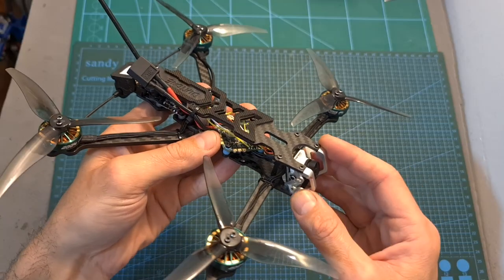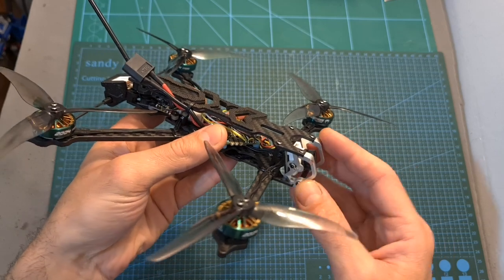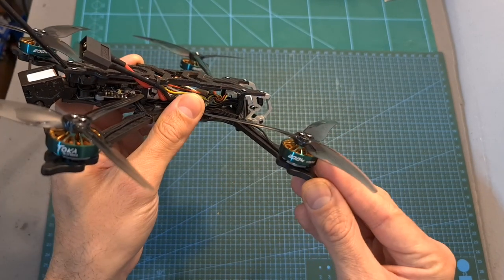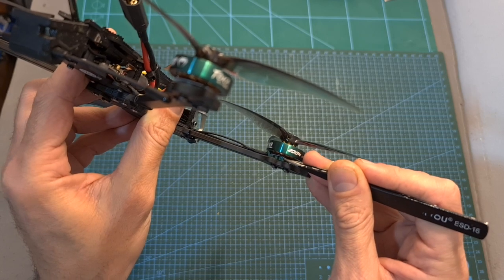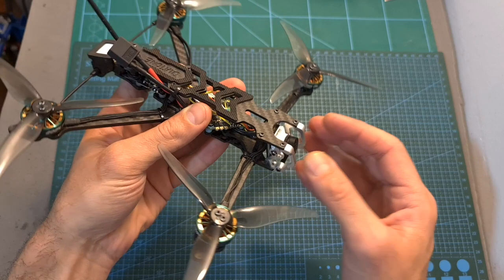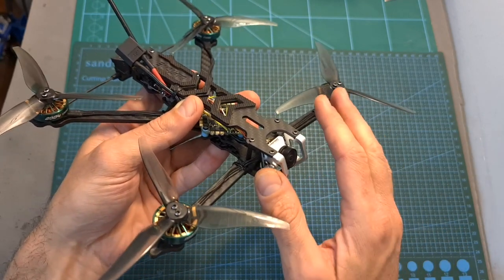Using the 4S lithium-ion battery, the DIATONE Roma L5 didn't feel very powerful, pretty much as expected, since these are the 6S motors, which I've already bench tested, and I can see that on their final version, now they have a nice little plastic protection on their bottom. And after going over the thrust test again, I can tell you that you can also easily use a 4S lithium-ion battery on the 4S version.